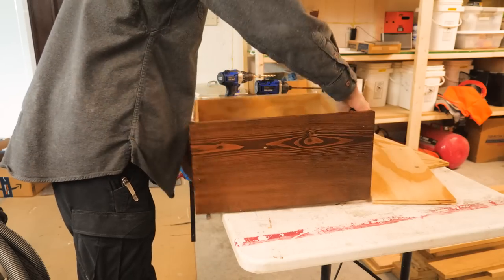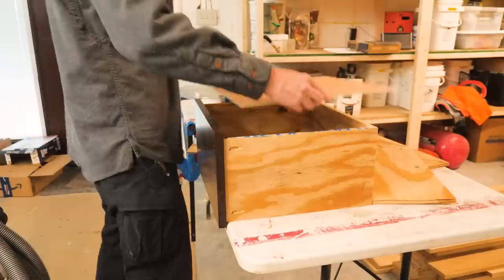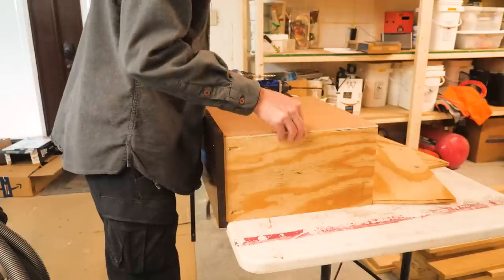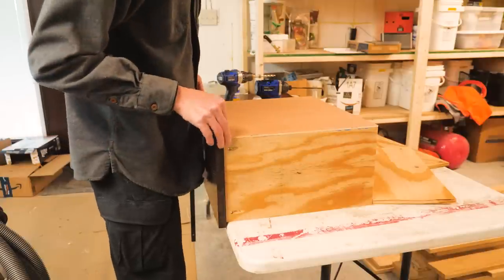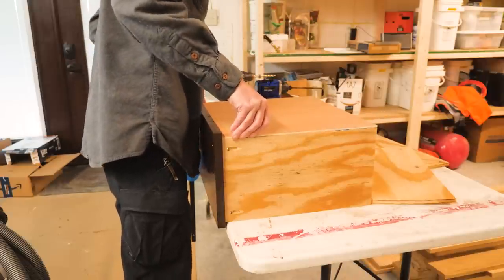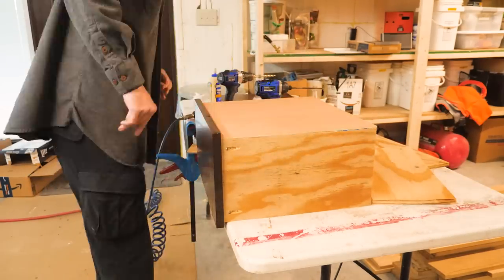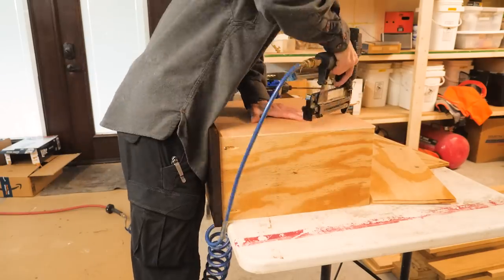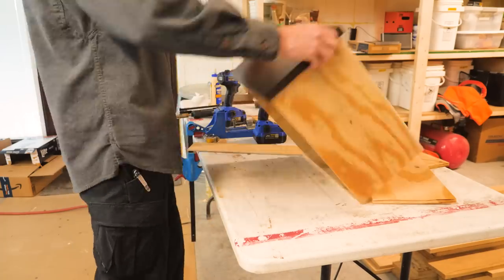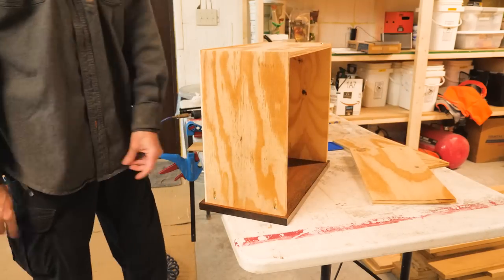Set the bottom in, do a dry fit — that works pretty good right there. Double check everything for square, because it has to be square for the drawer slides to work. Pretty nice drawer. Just do that eleven more times. Here's a little trick I figured out: when doing custom drawers with relatively inexpensive drawer slides that have no tolerance or forgiveness, I take two sides of the drawer, the two drawer slides, and the back, and make sure it all fits perfectly front to back without binding — because that's basically how your drawer slides are going to work.